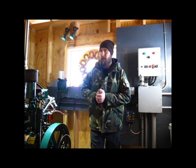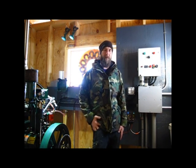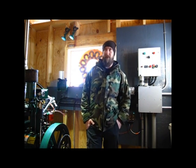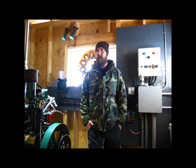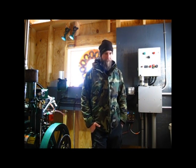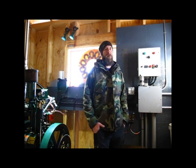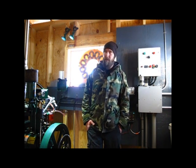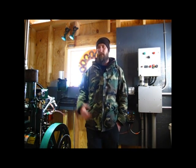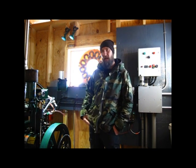This engine actually turns 10 years old this year. If you guys have been following the progress of this project, you may remember a post I made on the Field Lines Forum back in 2008. We did some calculations for fuel efficiency and basically figured out about 9.84 kilowatt hours per gallon of diesel — that's pretty good. We did those calculations at sea level and in the summertime, and the only difference now is that we've relocated to about 1,200 feet above sea level and we use it primarily in the winter, so I may want to redo those calculations.